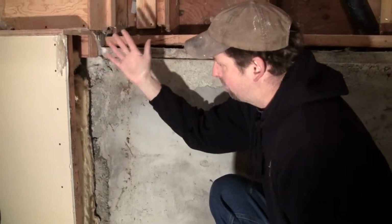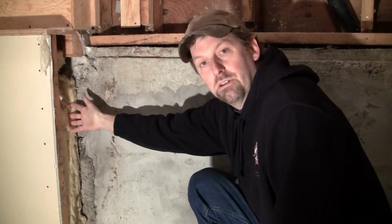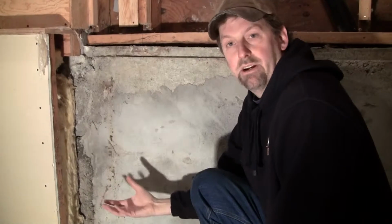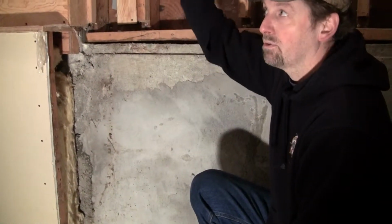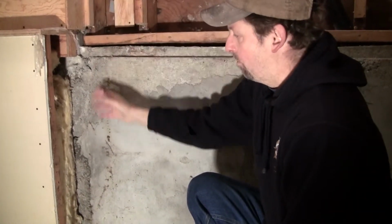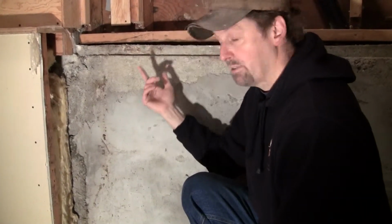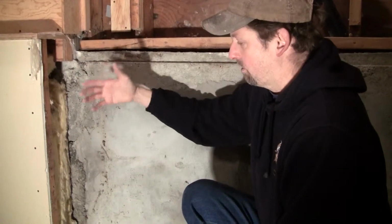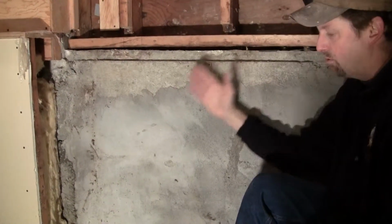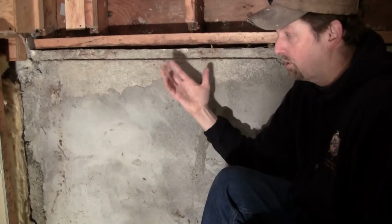wall. In referring to the Mike Holmes book, when you have standard insulation up against a concrete wall, you have air circulation. And because the earth is a constant temperature versus the air in the room, when you have a wall that's open like this, you're going to have air circulation, therefore temperature differences, therefore moisture. Moisture in the walls creates problems, and so we've removed all the old wall that was here to expose it, to see what the structure is, and rebuild it properly.